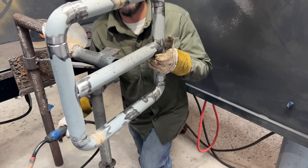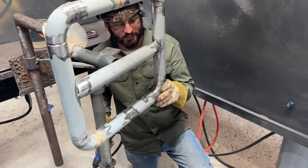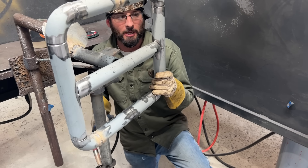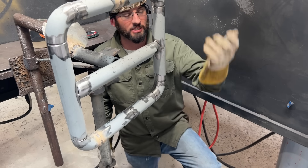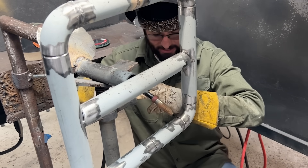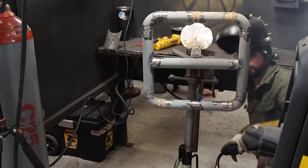If you're building handrails and welding them like this, it's not usually the order you go about it. Normally you prefab them uncoated or ungalvanized, then build the handrail, then galvanize it afterward. But the people installing will probably have to do a little bit of this, and of course the people doing repairs too. In my experience, I was welding handrails for a power plant when there weren't any pipe welds to be made — there were handrails already tacked with crap on them, and you definitely had to clean them up just like we did today.